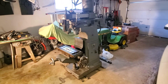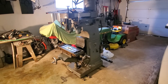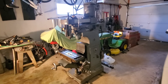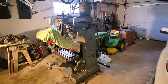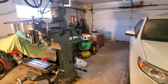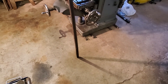This was delivered on a pallet — this one came from Global Machine Surplus — on a very stout pallet made out of pressure-treated 4x and 2x4 lumber, about six inches off the ground. I used a pair of automotive jacks to slide it off the pallet and worked it down really slowly. I lowered it off the pallet over by the garage door and rolled it over to where I'm going to disassemble it. I was helped by my good friend 'Johnson' here — a Johnson bar, a great big piece of steel with a chisel point on the end.